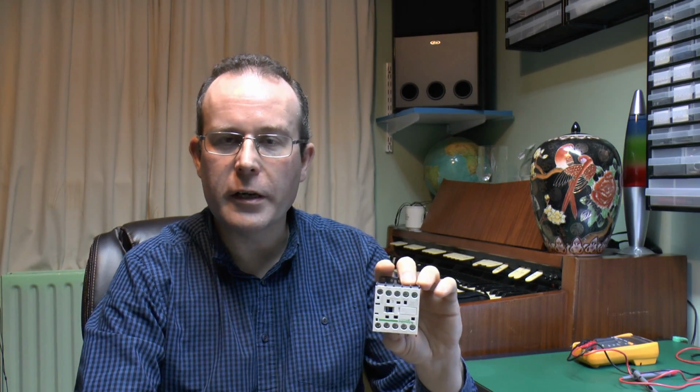And certainly for styles like these ones, quite a lot of choices are available, and in many cases if you haven't got the exact set of switching contacts that you want, you can buy additional contacts which normally either bolt or clip onto the side, so in that way you can make up any kind of configuration that you want. It's also possible to have one contactor switching other contactors in a whole complex arrangement, so you can get some fairly complicated things going on with those.